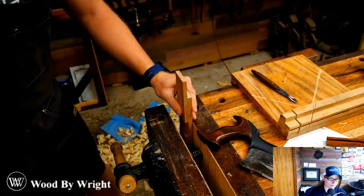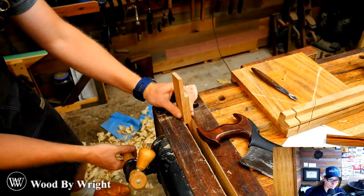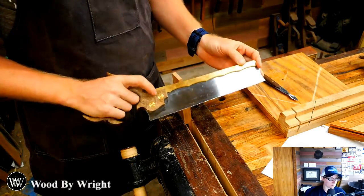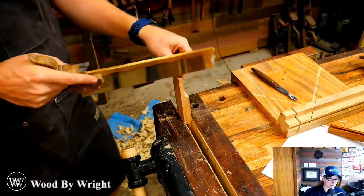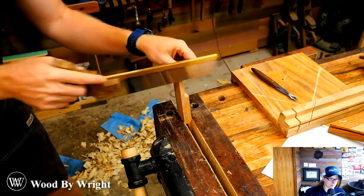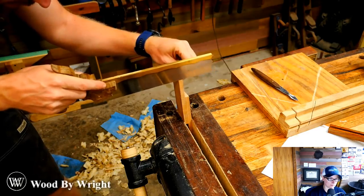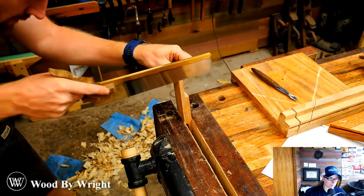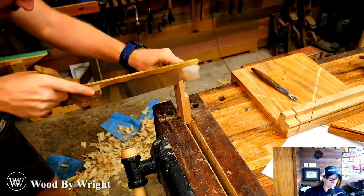I'll turn the board so that line is basically vertical and grab my dovetail saw. The dovetail saw generally has rip teeth with very small teeth, but a smaller plate for more control. I'm going to let the saw rest back on my hand so I can saw up here without the saw touching the wood, and I'll just nick until I create a little shelf right on that corner. Now I have a ledge I can cut on and cut right down that line. Once it's established it's just like any other cut.